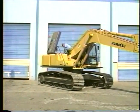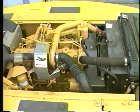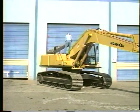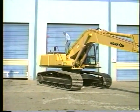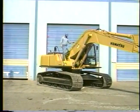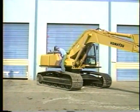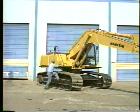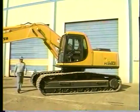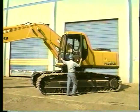The engine oil should be checked with the engine stopped and the oil cold. Also check for fuel, coolant, or engine oil leaks before closing the engine compartment door. Check behind the boom for hydraulic oil leaks. If all the levels are satisfactory, we can climb off the house. Now we can enter the cab for startup.